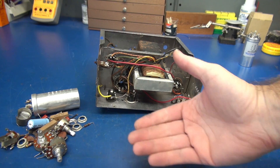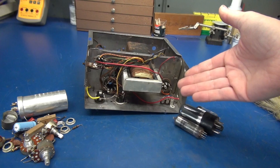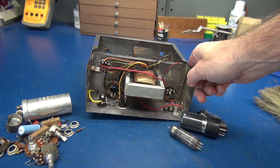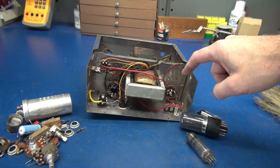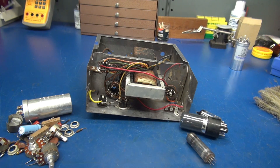She's pretty much stripped down. You can see the pile of old parts. The chassis is ready for rewiring. The thing I spotted though was the socket for the 12AX7 — the pins appear corroded. So I'm going to go ahead and remove that socket, put in a new one, and get those filaments hooked back up.